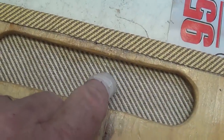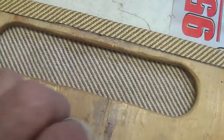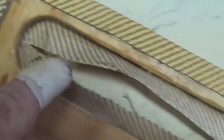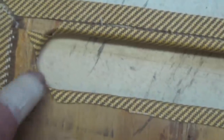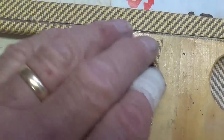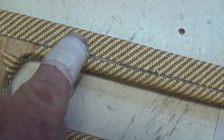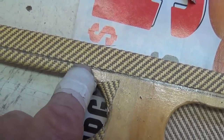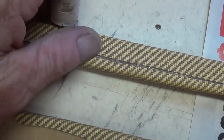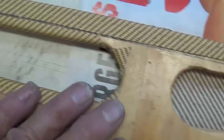and now the fun's about to begin as we start to cut the vent holes and fold the material over. Now one long slit down the center, and then little chicken feet here at the ends, and then just start folding over. Okay, after folding all the pieces over, you roller them with the linoleum roller, and if this flap here overlaps the top, then just cut right down the line here of the top edge and remove the extra so that they butt together right here in a flush seam. Okay, now it's time to do the other one.